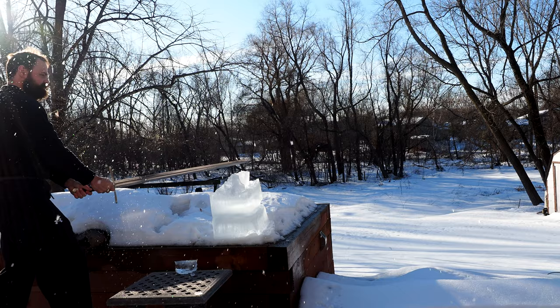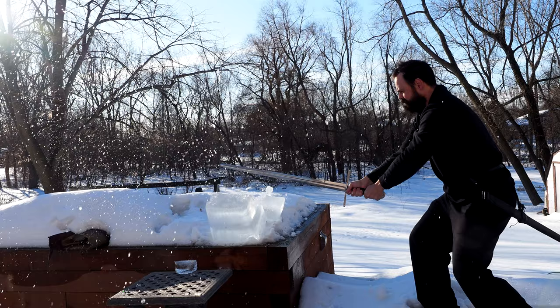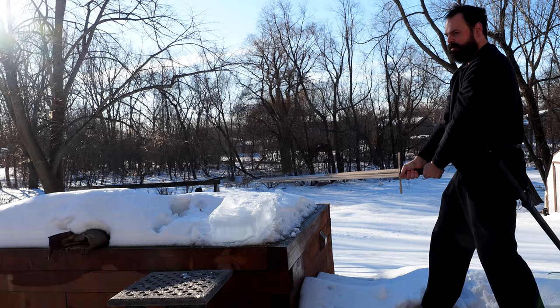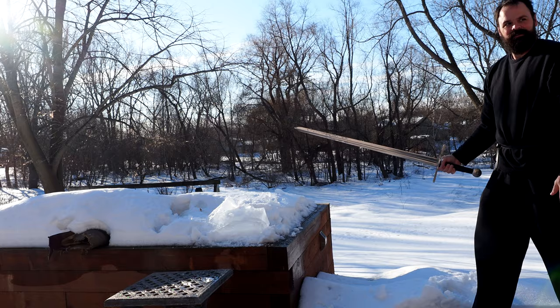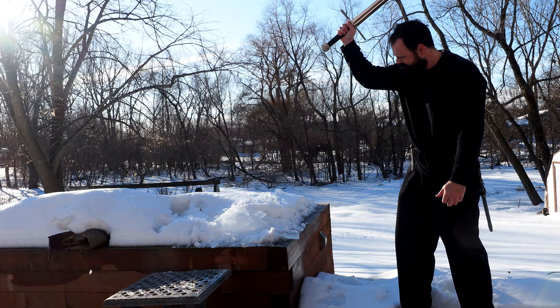So, as I noted, I have bashed ice blocks with this, and the sword is still very straight. There's really no discernible edge damage with the exception of the tip that got whacked into a concrete floor. And that's what I would expect from a sword made of 1060 and well heat treated. Also, that is as thick and robust as this. It's not going to take a set or a bend very easily because it's a very thick steel bar. Now, not very thick by crowbar standards, but it definitely adds some cumbersome feeling as you're trying to move this